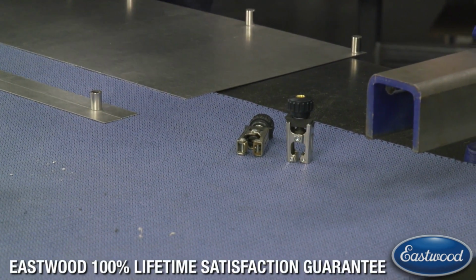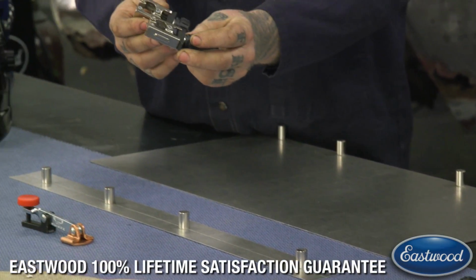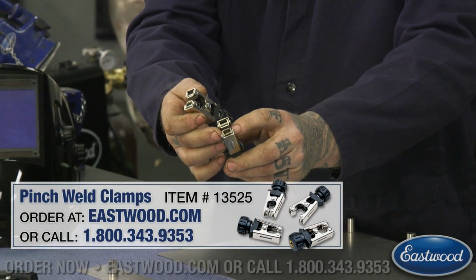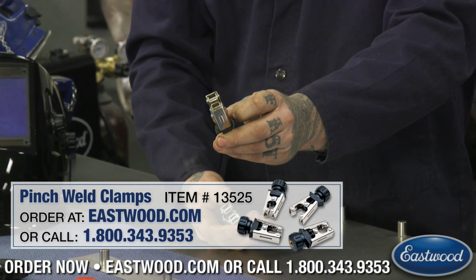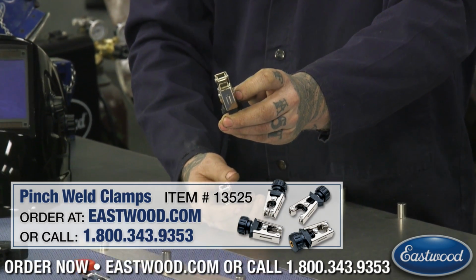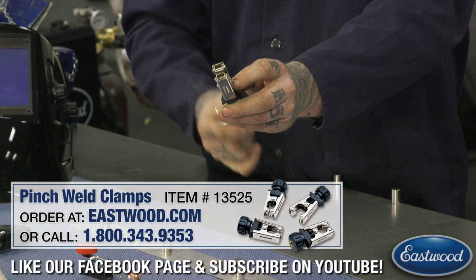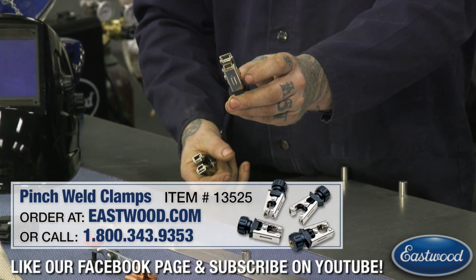So we have these little, we call them pinch weld clamps, but they're mini welding clamps. The cool thing about these, they have these little metal jaws on them, and they have a ton of strength to them. Yeah, it's like 250 pounds of clamping strength. So if you're pulling together an edge of a panel that you need to be really tight, and maybe it doesn't fit perfectly, you can pull a panel together really nicely with this.